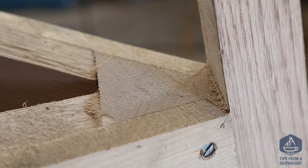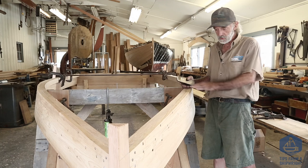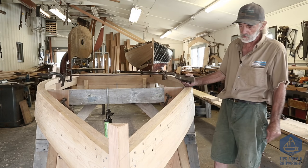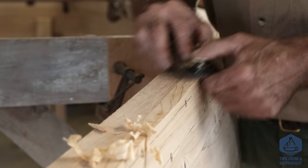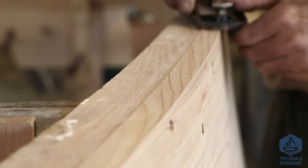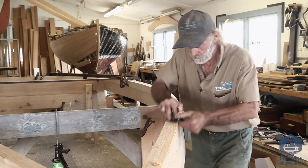We've sawn that excess material off along the chine and cut it off nice and flush up forward at the stem end, but the saw wandered just a tiny bit and I've got a couple of little lumps here. So I'm going to pick up a block plane and just tune it up a little bit. Right now I'm planing away at just the cedar itself to get it flush with the outboard side of that chine. We'll have to do a little more planing later to get it flush all the way across, but for right now we're just trying to make it look a little bit more presentable.